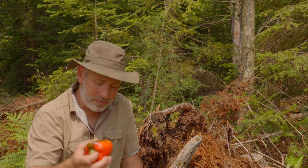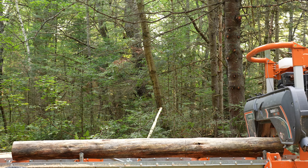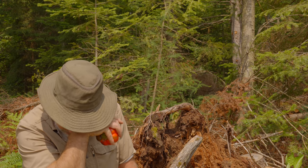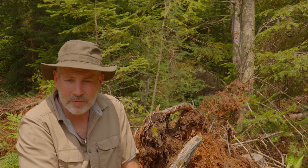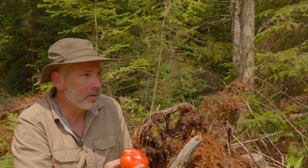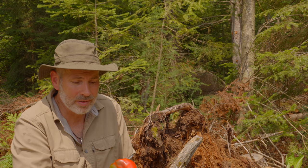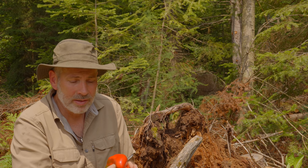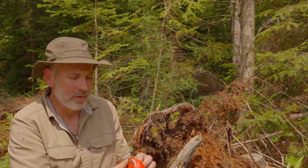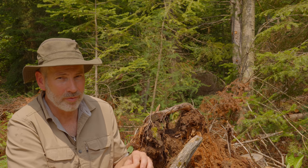As far as the wood, you saw me milling the timbers, or milling boards for the cabin. I'm continuing to mill stuff. I've got a bunch of trees cut down, and what I've learned just doing some research and getting some experience milling is that when you cut a tree down, the log sits, it doesn't really dry out. You would think it dries out and gets lighter, but it takes so long that the amount of moisture that leaves those logs is not meaningful. So you have to get them milled into boards and then protect them from the weather.